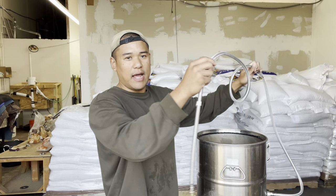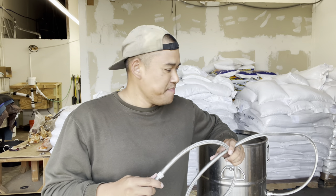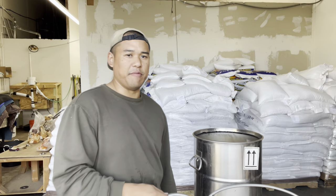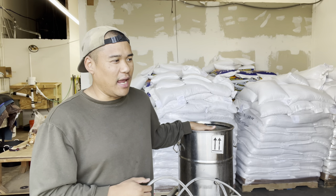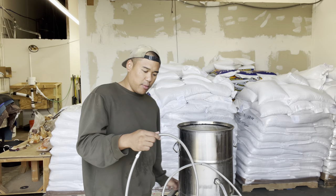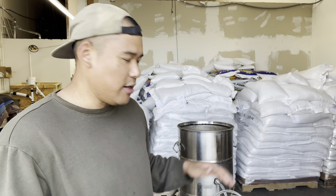The first thing you'll see is this water line hanging out. I bought it at Home Depot — it's just a universal laundry attachment water line. The great thing is it's metal, and the reason that's important is because it's connected to our steamer barrel. This barrel is going to get really, really hot, and if you have any plastic fittings on there they can melt pretty easily. Metal thread line works best. If you buy the eight-foot universal water line at Home Depot it'll have all the fittings you need.